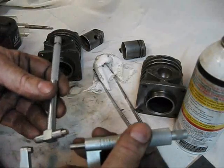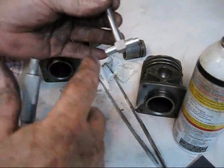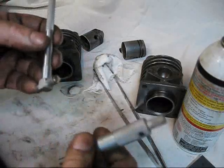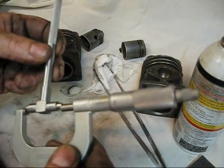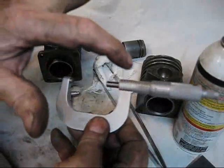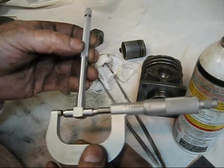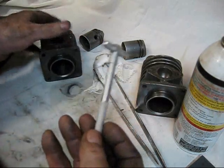You do have to get the micrometer out. This is actually a two-inch mic, and the way you use it is you put your bore gauge between the contact points and mic the distance, which in this instance came out to be one and one half inch. That surprised me — that measurement is the reason I was fidgeting around here. You won't find them like that very often. That's a darn good fit. I'm just going to take my word for it: it's 1 thousandth. That's a correct measurement right there. Pretty good — I'm going to call it 1 thousandth.